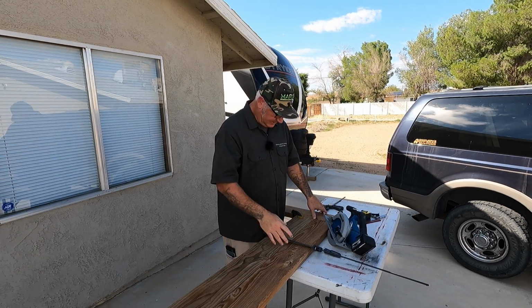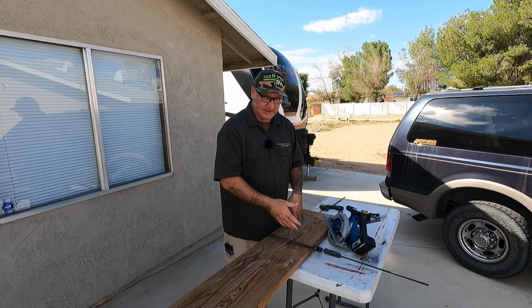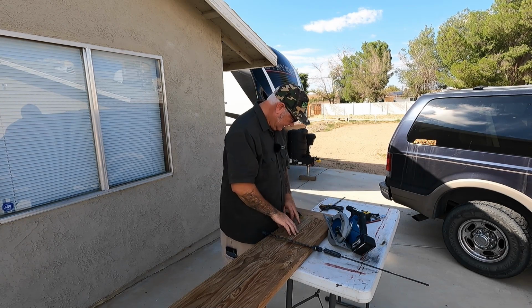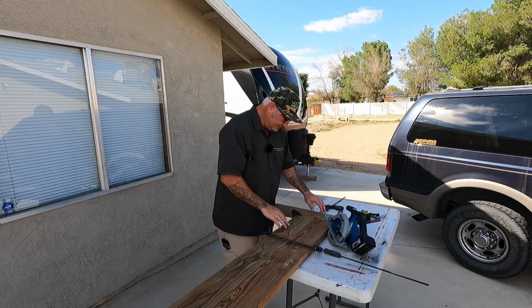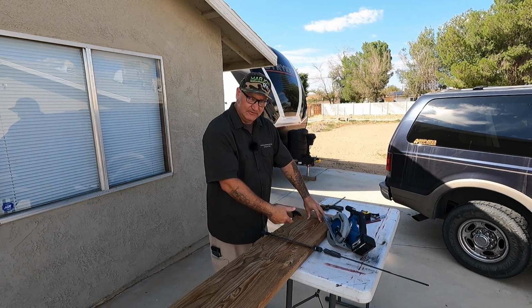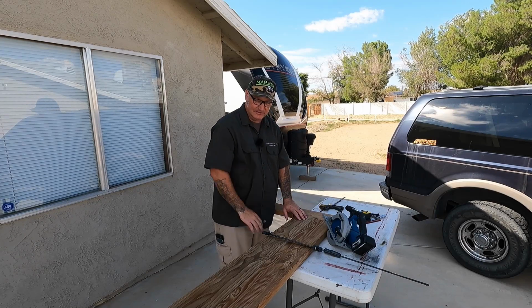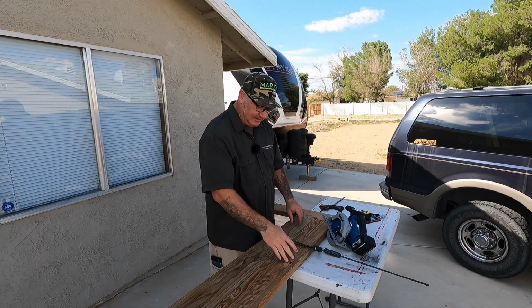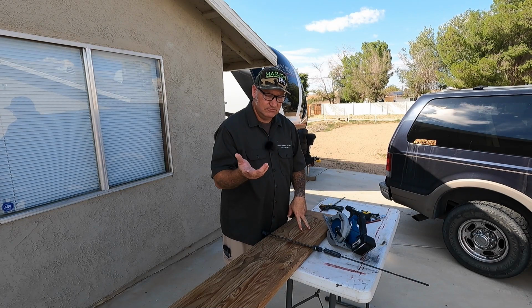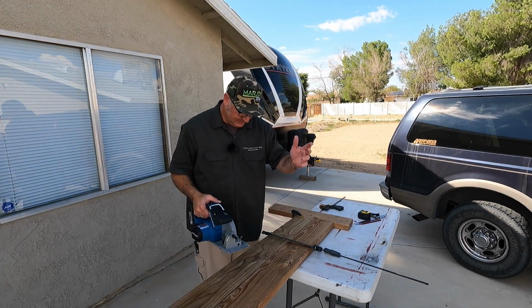So I've done some setup here, and we're going to go ahead and cut the two 24-inch pieces of the 2x6. This is for around the top. What I've done is I've taken this piece of wood here, butted it up against the bottom so that they're even, drawn a line on it, put this clamp to hold them together, and put a clamp here to hold it down to the table. Now I can cut this line, and they should be exactly the same, more or less. I'm just going to cut it straight across, and then we'll measure for the 22-inch parts, and that'll be the top.